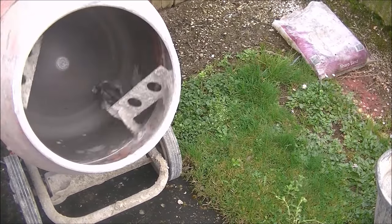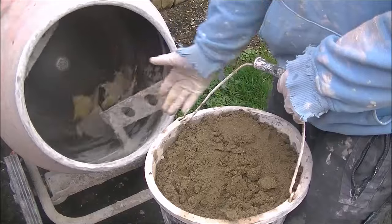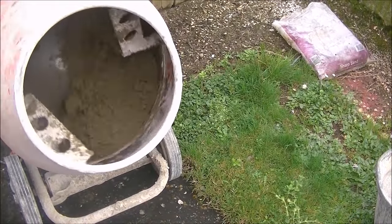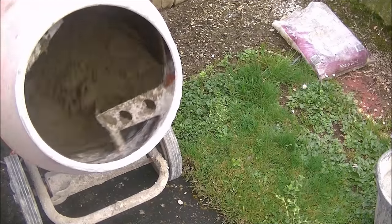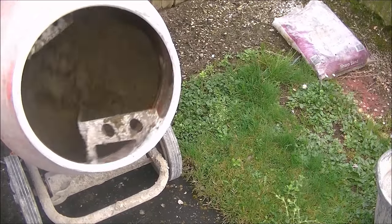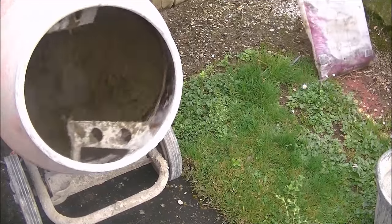So I'm going to show you how I make the screed up. Normally when mixing I'll use damp sand and a mixer. I'll add my damp sand first — I don't go crazy with water. You do not want a wet mix; it will be nearly impossible to get a good floor with a wet mix. This is not concrete — it is floor screed, a sand-cement mix, so you want it semi-dry. It will still be a very strong 4 to 1 mix.